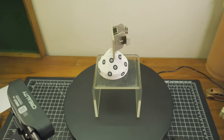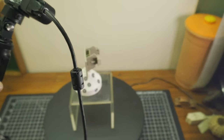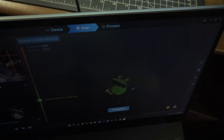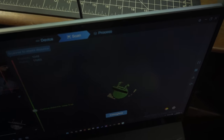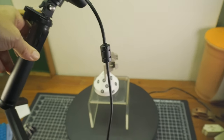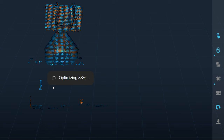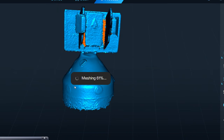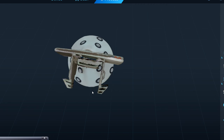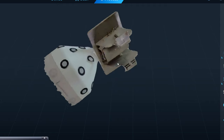Once we get all around the part, I'll lift the scanner to get more points on the top. You can use this handheld too, but for a small part it takes a steady hand — it's got a narrow field of view, so it's easy to move just a little too far and lose tracking. Once we get enough points, the software converts them to a mesh. It looks really good with the skin and coloring on it, but looking at just the geometry you can tell there are some imperfections — though it's pretty close.